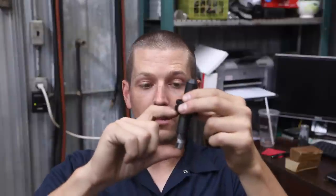That's the beauty of insert tooling — you're only buying a little replacement part. This single-flute tool is not going to chip weld, just not. That's a huge relief for me. From a job shop business or machine shop operational side, this tool is incredible. It will be used in I bet 90% of our jobs — it's a simple one-two-three punch where you use this to hog everything out, come in with finish end mills, and you've got great reach. It's just awesome.